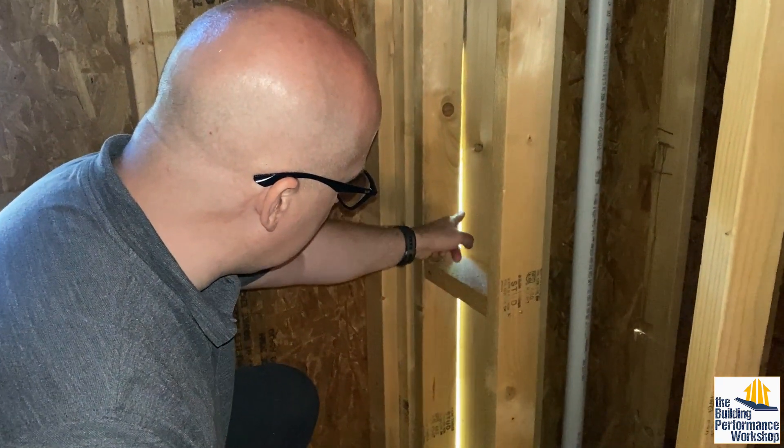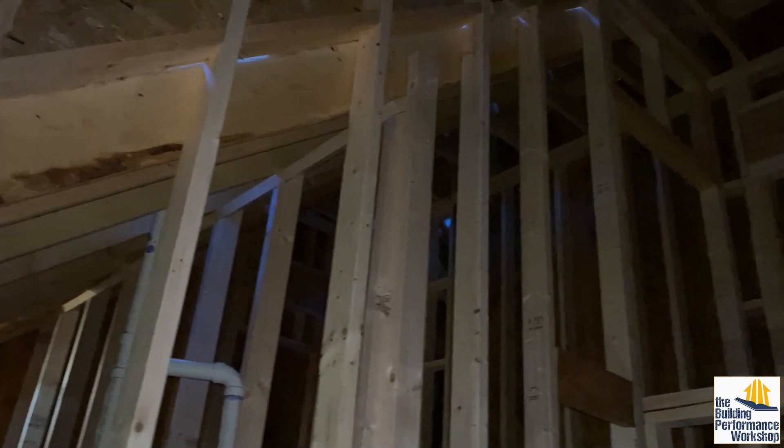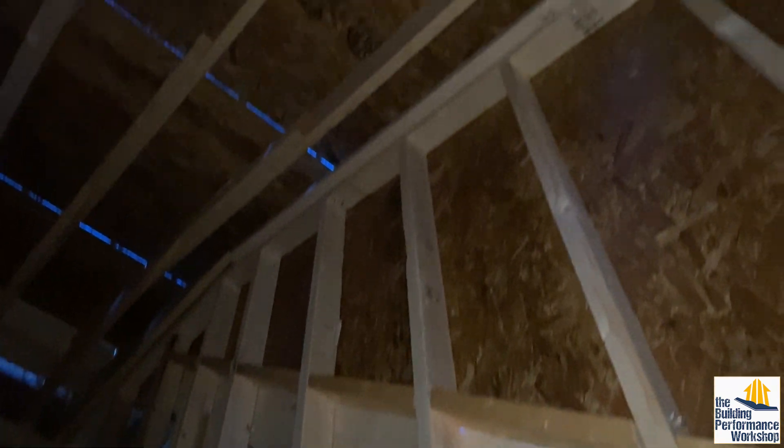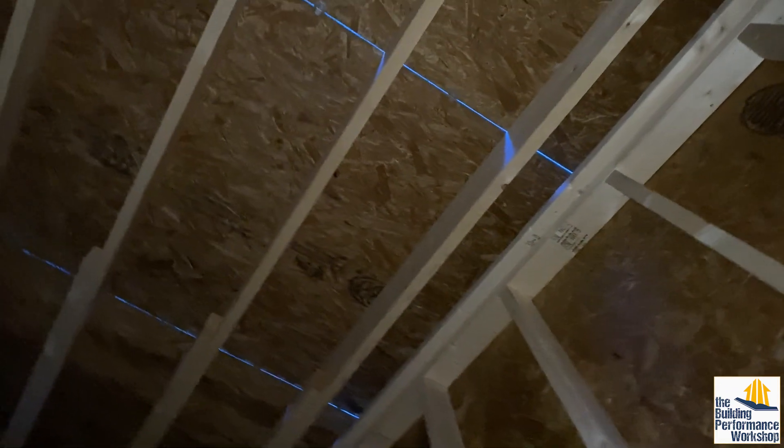What we're going to do is seal that up and spray it on the outside. If daylight is coming through, that means air is coming through as well. This is just a good example — it wasn't constructed improperly, it actually looks really good from the outside — but once you see the daylight come in you realize that is a weak point in the building envelope.